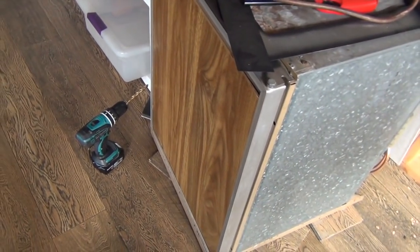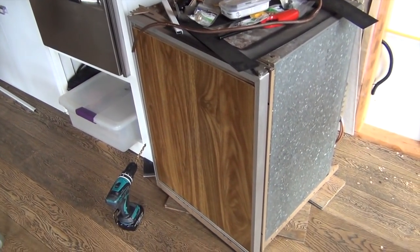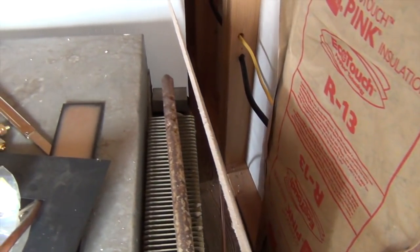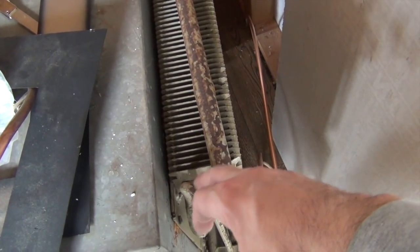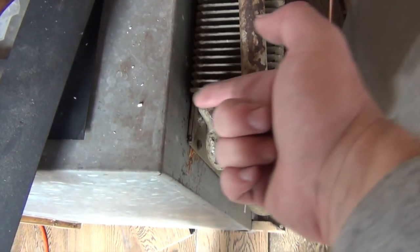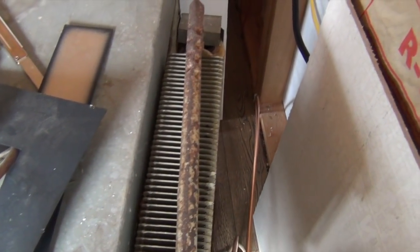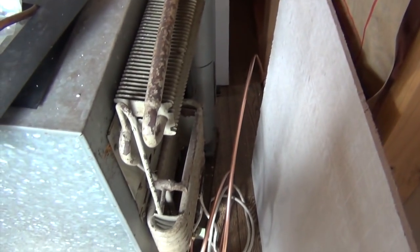You probably have already seen this in some videos. This old Dometic fridge from an old RV. Same RV had the range, stove top, and just a mini fridge. So I don't know how much we're going to use this. I just have it plugged in. So maybe we'll use it or not. I have to make sure, on these old refrigerators, they're a little scary, to be honest. This is a fireboard, and I think I'm going to put some of this concrete fireboard up here, because in a weird event, if they start leaking out of this, rusting, it doesn't really matter what they look like. It's more where it goes into the fridge, where it rusts out over time. And you'll start to smell this ammonia smell. If you start smelling that, it's time to get rid of the refrigerator, because it's already leaking, it's already losing pressure. So basically, you have to keep an eye on that.